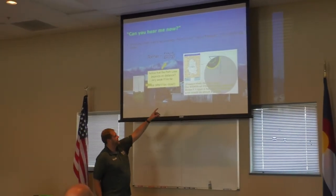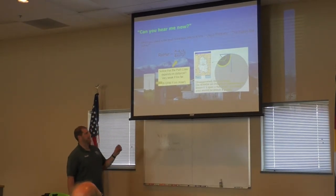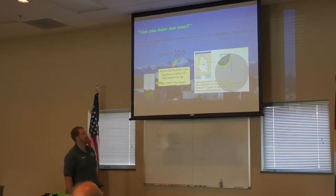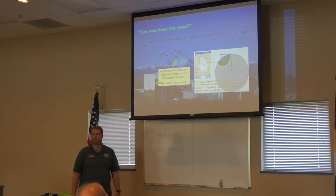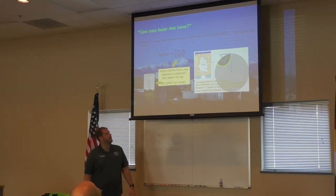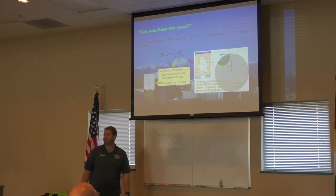It's kind of hard to see. There's actually a green antenna that would be a smaller height, about half the height of the blue antenna, and then some geometry showing you basically where the Earth is going to start shadowing and blocking where you go, and you can see that you can cover a lot of range. As a matter of fact, the coverage here on the left is the NOAA weather for our general area. They've got a transmitter up on Cheyenne Mountain, and the coverage area spans all of those different counties. It's not to scale. Compared to the Earth there, that whole coverage area would be about 4 pixels, and the mountain isn't even visible.